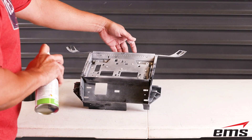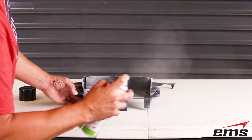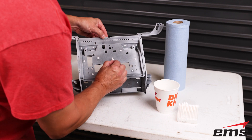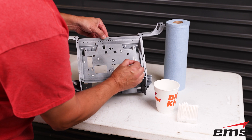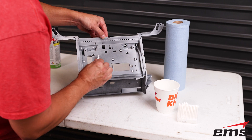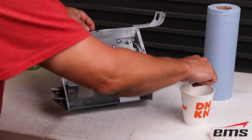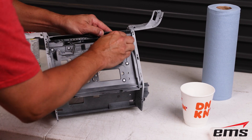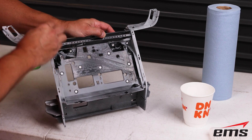Another issue is if you need to travel somewhere via an airplane to do some 3D scanning, you can't take these sprays with you. Also, if your 3D scanner requires targets, you will need to apply the targets first, then spray the part with the scanning spray, and then use something to clean the spray off the targets — otherwise the 3D scanner will not see the targets. In addition, when done 3D scanning, you will need to clean the spray material off the part. On certain parts with fine detail, that can be a real hassle.